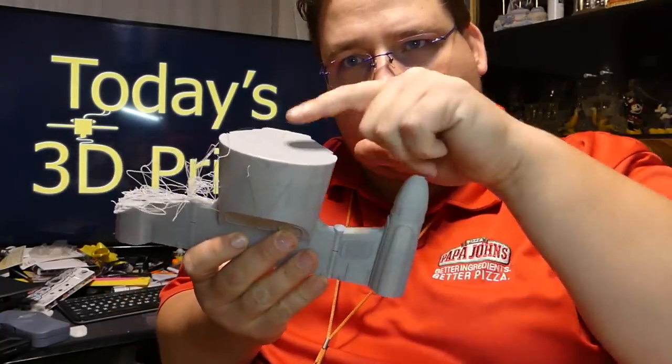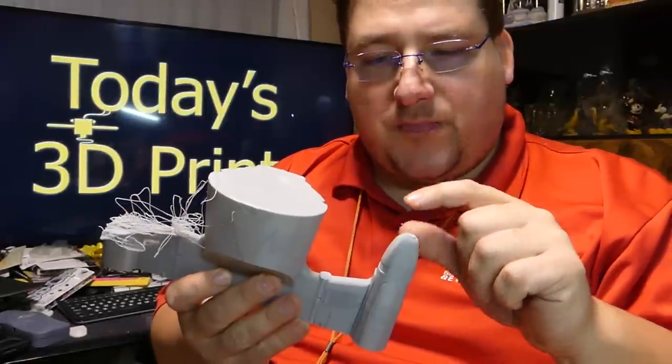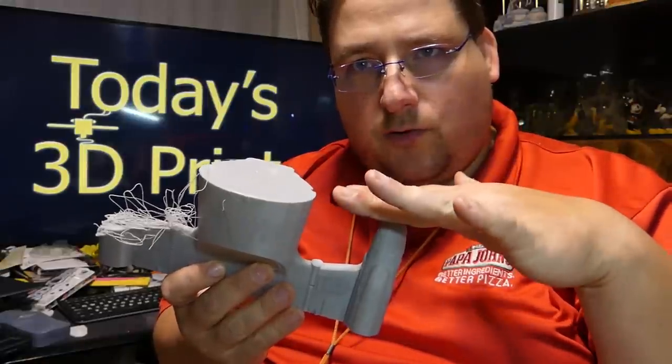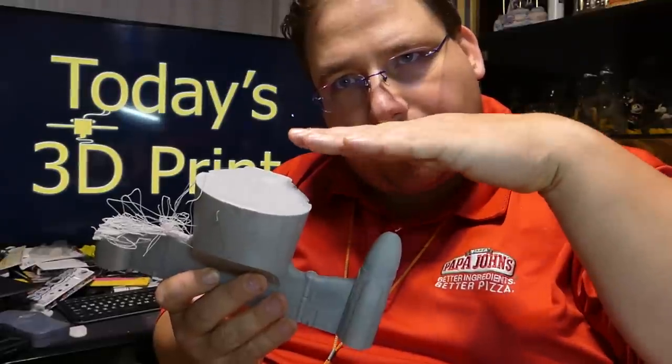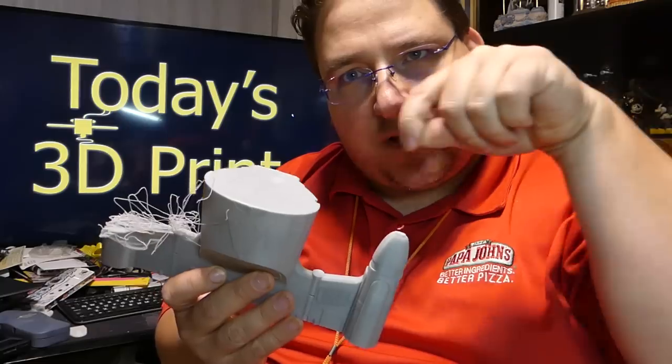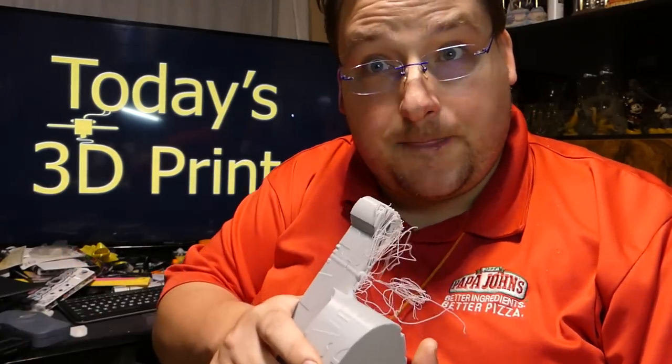What was happening is when this begins to print, it is three independent prints, this, this, and this. And when I have a 20 millimeter brim disc that I use to hold this one on, the brim disc was small enough that it was able to warp a little bit. And it would warp enough under pressure from the nozzle pushing on it, since the CR-10 is not as precise as the Ender, not because it's worse, just because it's 300 by 300 millimeters, and this is only 150 by 150 millimeters. So it's possible for this to hold tolerances much easier than it is for a CR-10. So that's why the prints on the Ender look so good. It's basically a tiny CR-10. As you get bigger, that's a consequence of getting bigger.